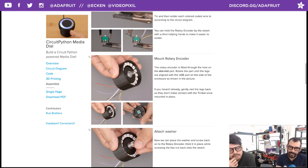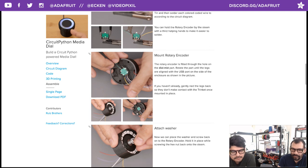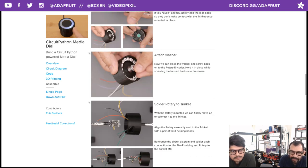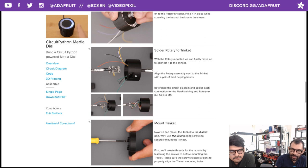You want to orient it so the legs are aligned with the USB opening on the enclosure, just so that they are aligned right over where the pins will connect to the Trinket once it's mounted. Scroll down. Looks like I skipped a couple of steps there. I already talked about the washer and the hex nut. Replace that. Moving on to actually soldering all that to the Trinket, you want to, again, just line those up